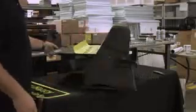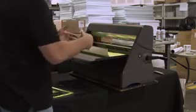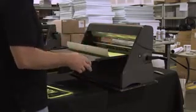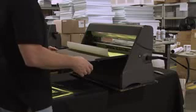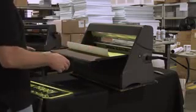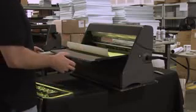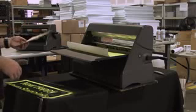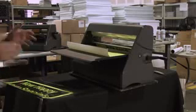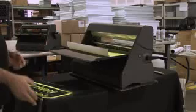I'm clear that it's not always that easy — it might take several pieces of cardboard. If you've got wrinkles on one side, put the cardboard on that side. If you have wrinkles in the middle, start the cardboard there. Eventually it will clear itself up. My guess is the most waste you should have, once you've done this a couple of times, is probably about five feet or so — this was only about a foot or two. If you start laminating and in the middle of your run you start getting wrinkles, just stop the machine, take the tray out, and feed some cardboard through where the wrinkles are. It should clear itself up. You don't have to take the rolls out — just insert your cardboard and go from there. It's that easy to load.